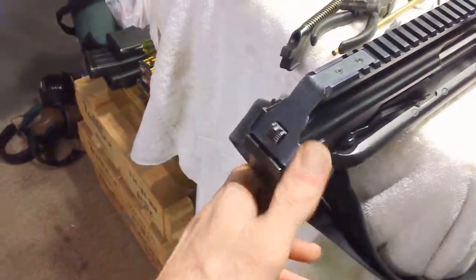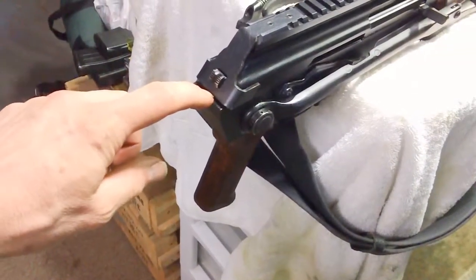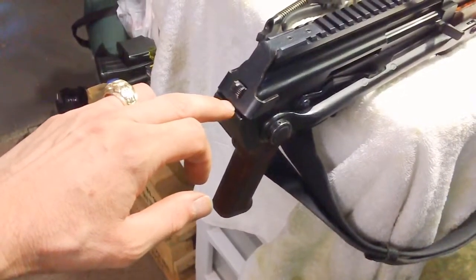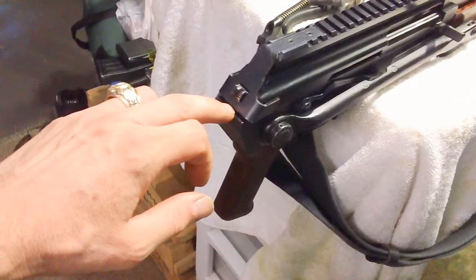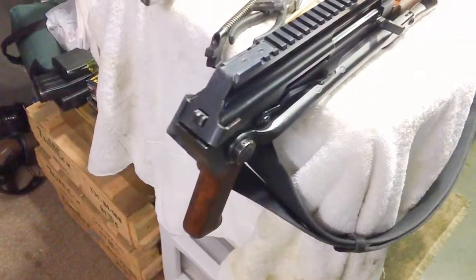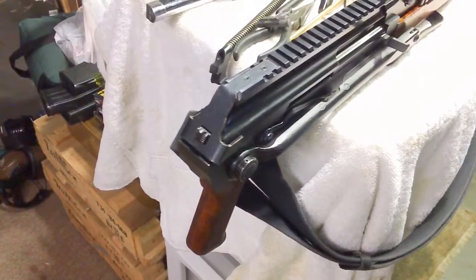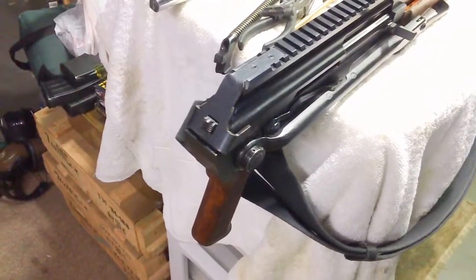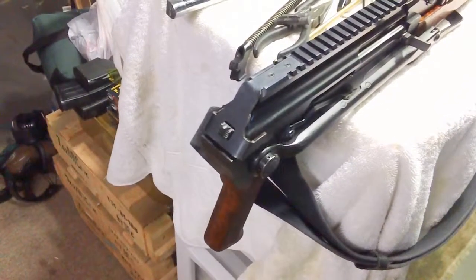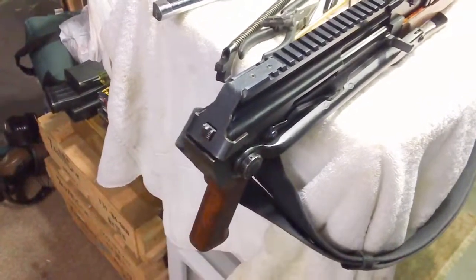Also, the other aspect I should mention, I forgot to mention in my video, is they have a little lip or a little tongue that comes out on the bottom of this one piece right here in the middle. They're originally set up and made for typical AKM, AK-74, and those types of stamped receiver variants. And you do have to modify it sometimes if you have a gun that might not accept it completely and properly, like this DDI milled gun right here.